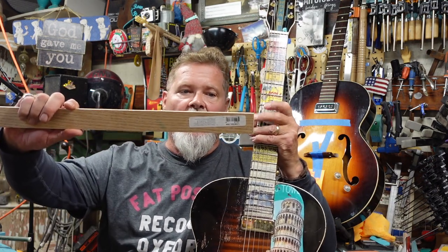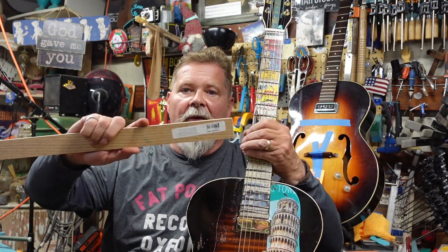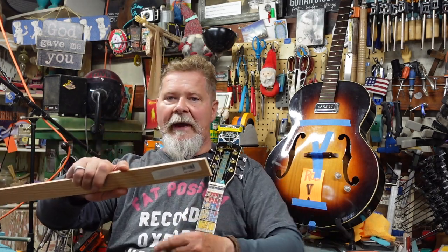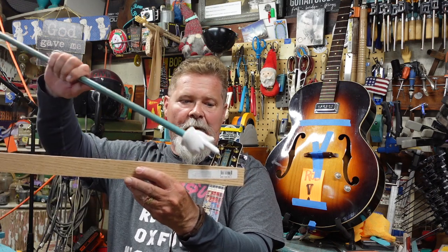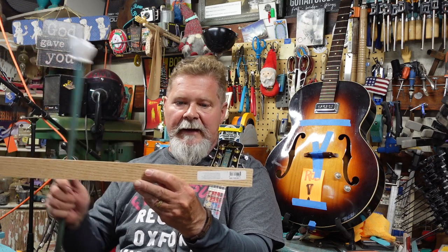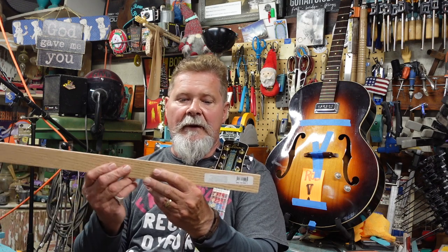on a piece of wood like this that's cut, two of them taped together, and we will be able to cut our radius. Let me see if I can do this. Don't eyeball that guitar, pay attention. I can basically take the radius that's at the bottom of the floating bridge now and create it here and extend it and make what's basically two braces.